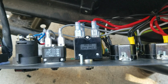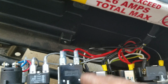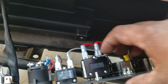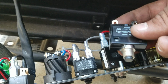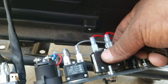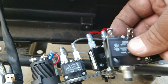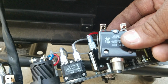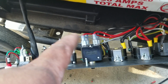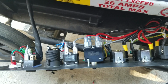Because I've installed it, now this thing should hold, it should not reset again when I use my microwave or my air conditioning. It's a pretty basic switch in, switch out installation. I bought a lot of 3 of these little breakers from eBay for 11 bucks. It's plug-in, plug-in and connect a switch. I've already done the switch here. I replaced the old switches, which were rated at 13 amps per switch. Now they're rated at 20 amps per switch.